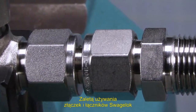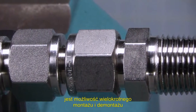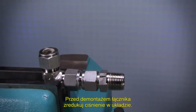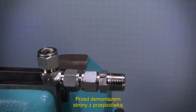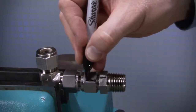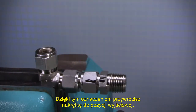One of the benefits of using Swagelok tube fittings and port connectors is their ability to be disassembled and reassembled many times while retaining the leak-tight seal. Always depressurize the system before disassembling a Swagelok port connector. For the tube adapter end, prior to disassembly, mark a line along the nut and fitting body flats. Use these marks to ensure that you return the nut to the previously pulled-up position.